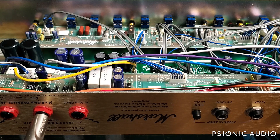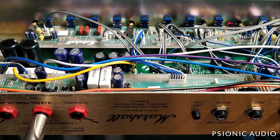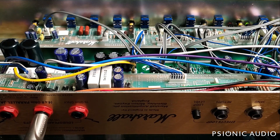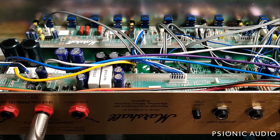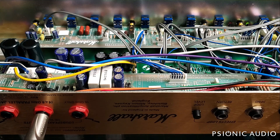It had one really noisy tube in the phase inverter — that's gone. I moved the old tubes down one position and put a 12AX7 in V1. Here's the clean channel and the dirt channel. It's working, the pots are all quiet, no scratchiness, everything seems very normal. But I need to let that bias run for a couple hours, get everything hot, and make sure everything stays stable. Then I'll put the wires back, neaten things up, put all the front panel hardware back in place, and do a real playing test once I'm sure the amp is going to be stable in use.